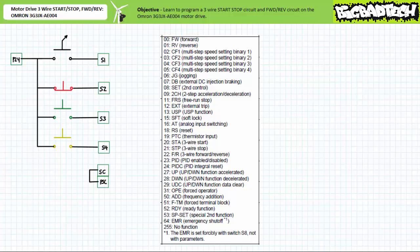Recall that Forward and Reverse act similar to a two-wire circuit in that the motor is energized in the direction of choice only when that particular input is actively being asserted. Any time the controlling input opens, the motor begins the deceleration period. A two-wire circuit therefore requires continuous assertion of the controlling input for continuous operation.